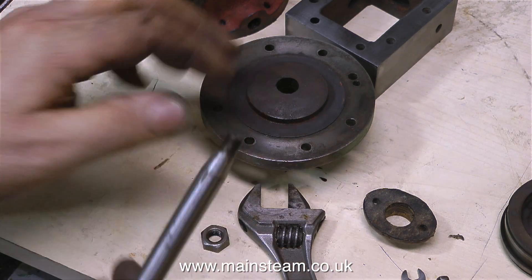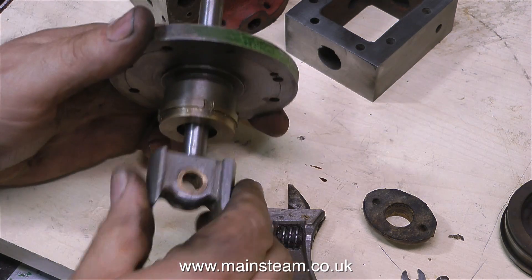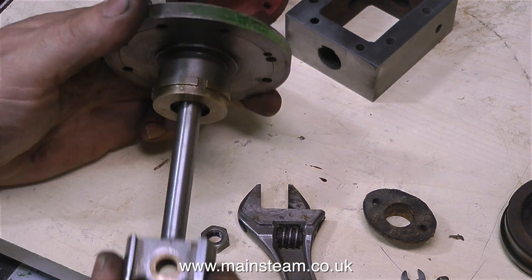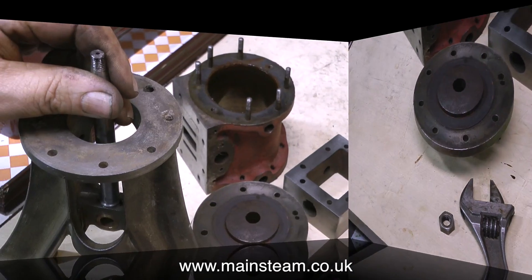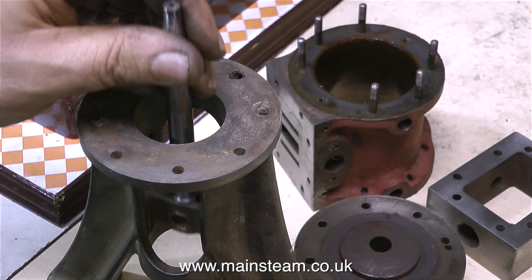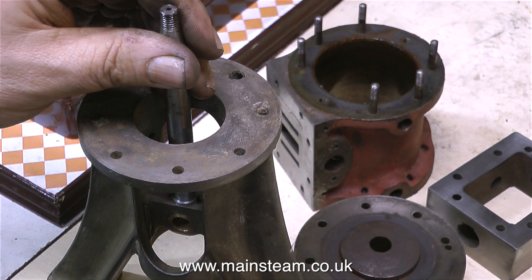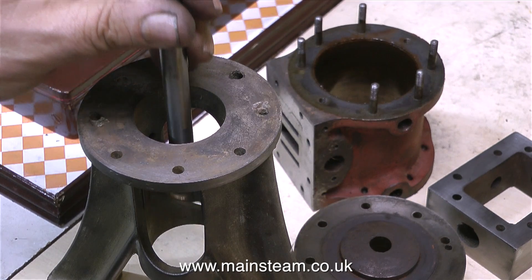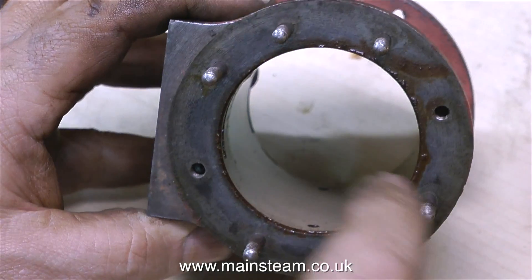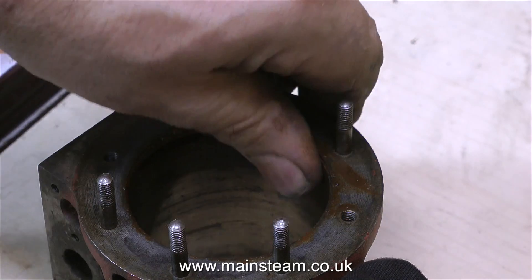In this clip I'm showing how little I've actually removed from this shaft by sanding it in the lathe. There's a little bit of side play but really not much at all. When I first tried to separate the cylinder from the crosshead it felt rather tight, but now when I place the crosshead into the crosshead guide it's not tight at all — so it must just have been gummed up. It's time now to take a quick look at the cylinder to see whether it needs reboring or sleeving. And it doesn't — it's in perfect condition. Really, really good. A finish like glass.